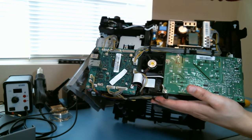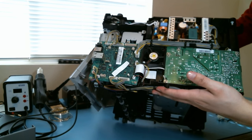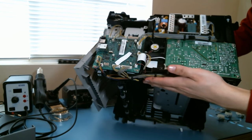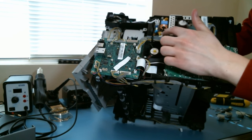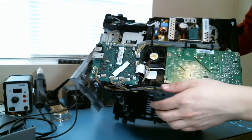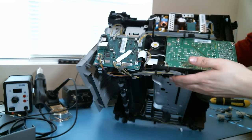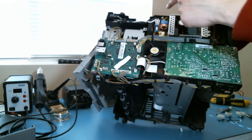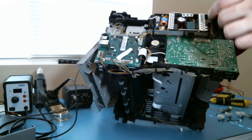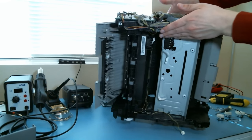Not quite sure what this is. There's a relay in here. So maybe there's a 240 volt or 120 volt mains connected heating element. The input with a big choke on the mains input, or their ferrite bead, looks like. Fused, and obviously it's fine. This thing's UL listed. It's gonna have all the mains protection necessary to keep your house from burning down.